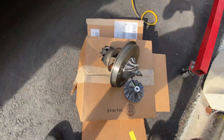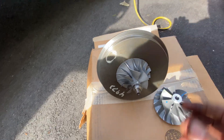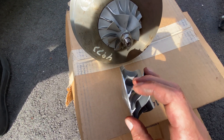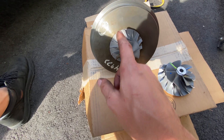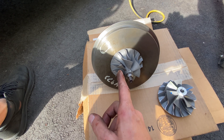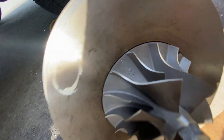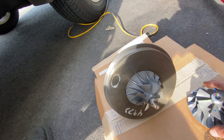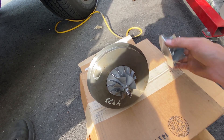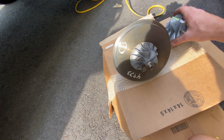I'm gonna take this wheel off and loosen it up because it has to go to the machine shop. Right here you can see how thick this is — maybe like an eighth of an inch — and it has to sit inside this plate. The only thing that needs to be done is this back plate just needs to be opened up a little bit, not deeper but wider, so this can sit in there. It only goes in about a sixteenth of an inch into the back plate. My local machine shop will hopefully put it on a jig and just scrape away at the edge to open it up a little bit more.